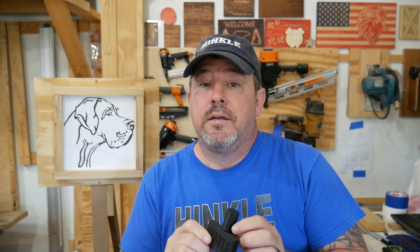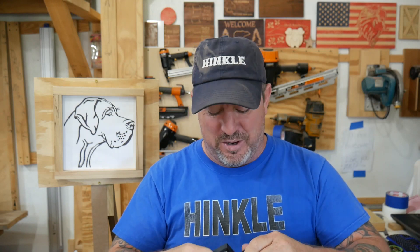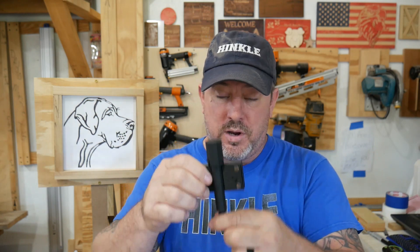He also thought about the fact that when the machine lifts off the material, the marker needs to lift as well — it needs to come up off the page and move. We talked about how to accomplish that, he corrected his design and fixed it. I also said we need down pressure on the marker to make sure it's pushing correctly on the paper, cardboard, whatever you're using. So he inserted a spring inside the cap. When you slide the marker down into the holder and put the cap on, he created enough travel so it will stay on the paper and a stop so it'll lift off the paper. The things I've drawn with this are just incredible.